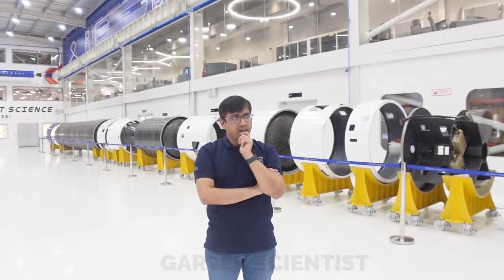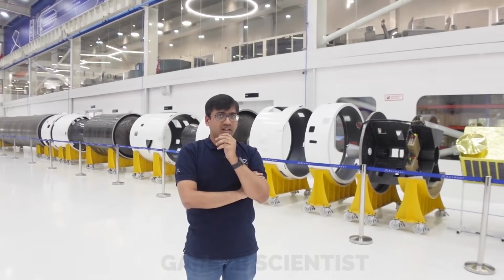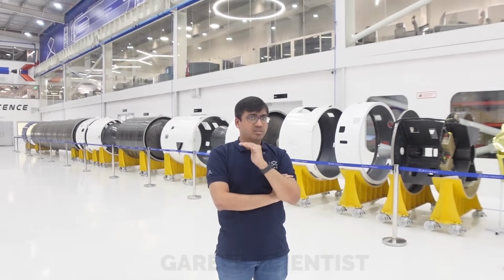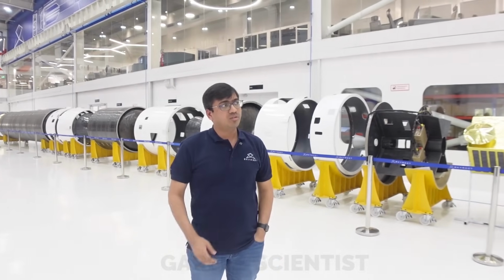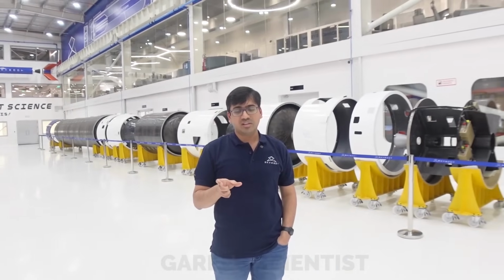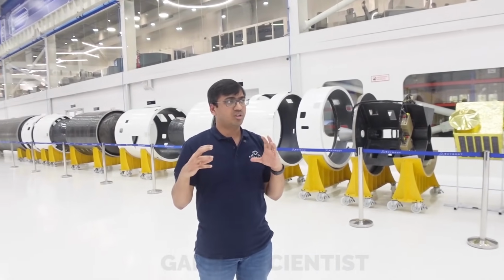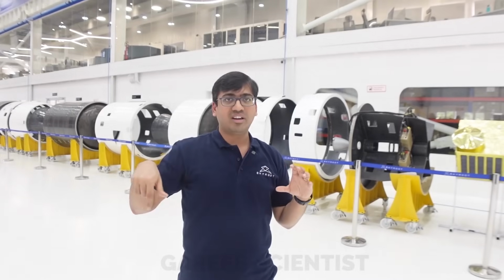Here, as I said initially, building up that expertise to do big motor winding is important, because the motor openings are different. When openings are the same, it's easier to wind. When there's an opening ratio, it is very difficult to wind, and our opening ratios are quite large. So that makes the winding very, very difficult.